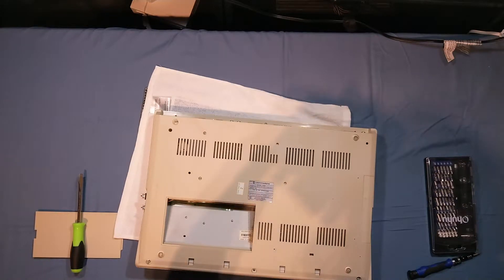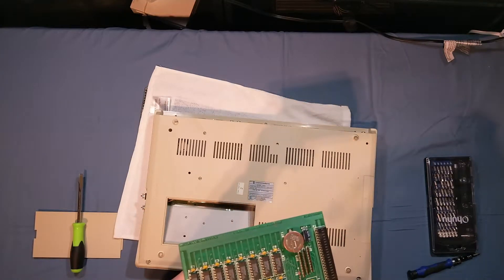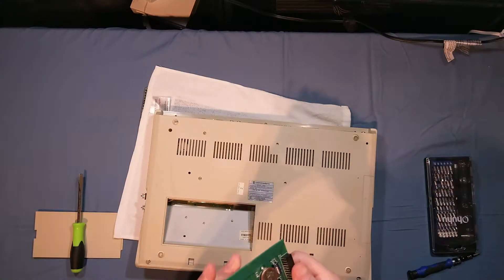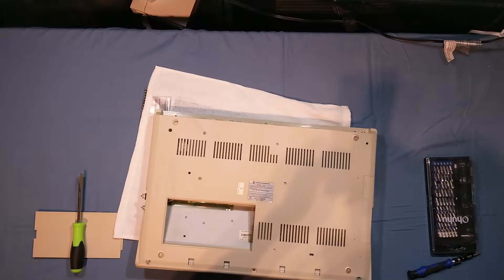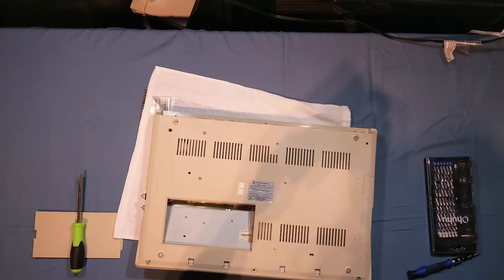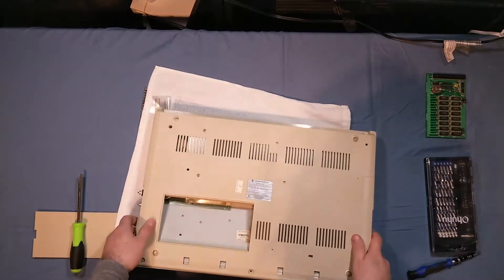This battery is from September of 1989, so yeah, this battery is getting replaced. If you saw my video on how to replace a battery in your video game cartridges, it's going to be the same process — I'm just going to have to desolder these two tabs. In fact, this battery might have been replaced already once because you can see some flux residue on there, although it's possible it came like that from the factory. You can also see some wires here from the switches that were installed.